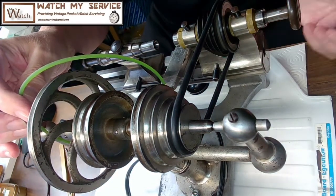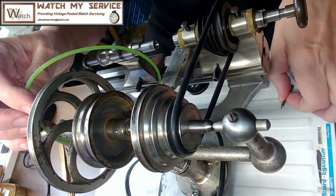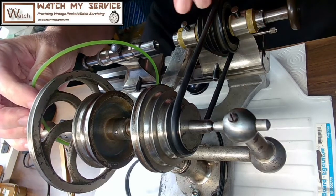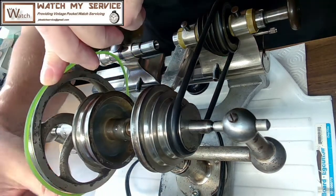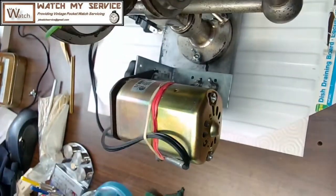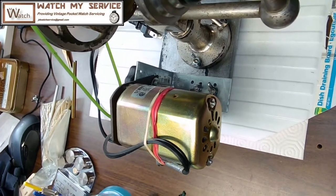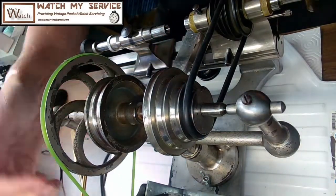Make sure the stop on the back of the lathe is out so it doesn't jam up suddenly. The lathe is pretty good so I leave it sticking out just a bit. There's a spindle on the end and I need to put a collet on it. On my countershaft there's a belt attached to a sewing machine motor — I attach the belt to the motor by rolling it over the edge.